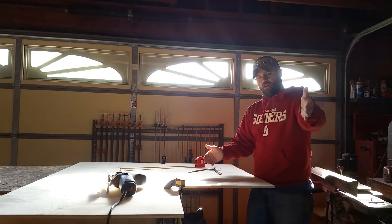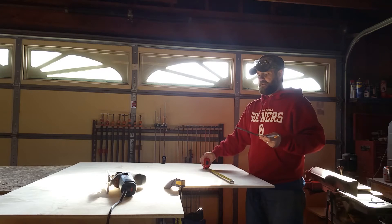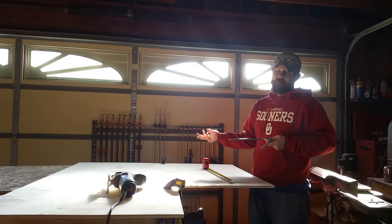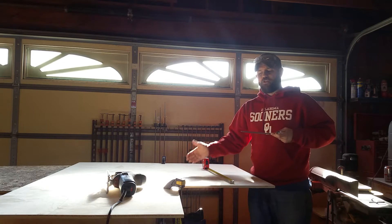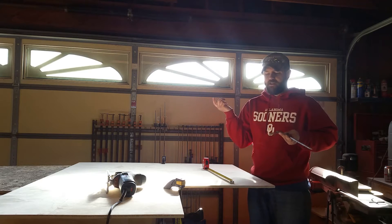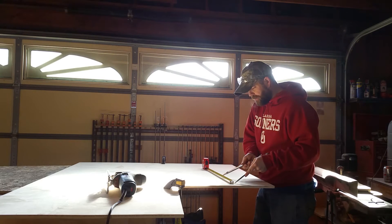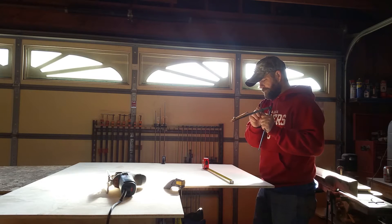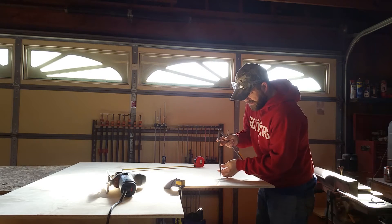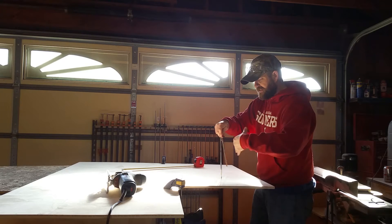After we have that measurement — which on my 16-inch is 17 inches — we're going to take our compass and make the circle. The major part of the circle has to be over 17 inches so we don't fall inside. We can make it 18 inches, but that gives us only a half inch on each side when we nest the mirror box cover down in. I actually like to make it a little thinner — you don't need more than a quarter of an inch. So I'm going to set my compass to eight and three quarters. I'll make the divot really well because this is where my router will go when I do my circle cutting for the inside.